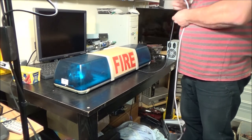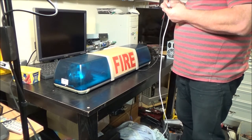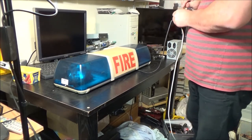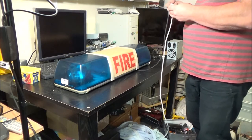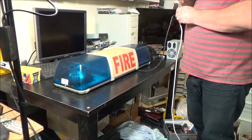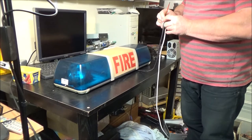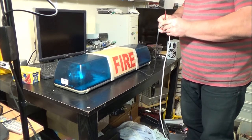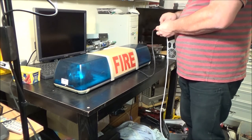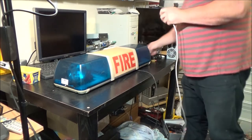What I'll do is connect these wires up how I think it goes, and before I properly terminate them to the switches and power supply, I will test them. I'm pretty certain black is the negative. So I'm going to use the blue as the negative, and I'll use the earth on this, another green and yellow one, as the other conductor for the other light, because it's 12 volts, plastic doesn't need an earth. So in this case, that's what that can be. That is actually ready to just chuck back up on the shelf now, which I will do in a moment.